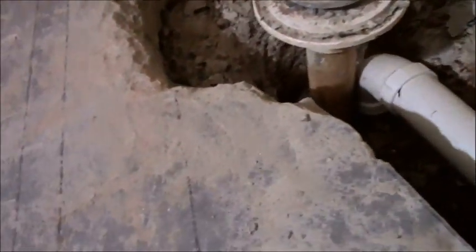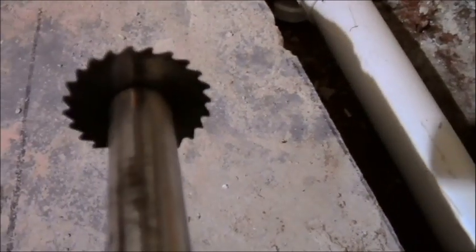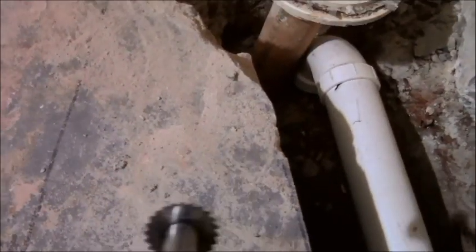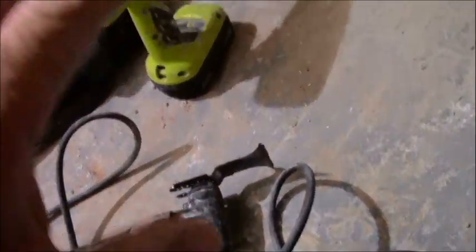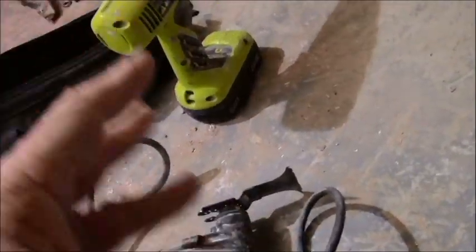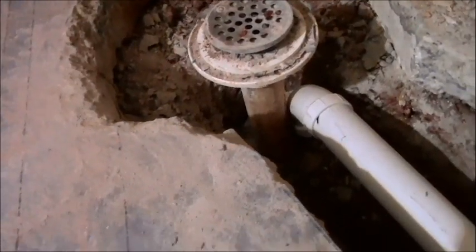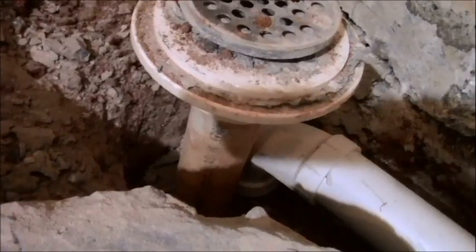And if I'm shy of that, then I can come in with an inside pipe cutter. It looks like a cowboy spur. If I need to take off another 1/4 inch, 1/2 inch, or whatever, I can go into the pipe and cut circular inside the pipe and get off any excess. So having good tools, not proper, because there's no such thing as proper, but having good tools that make your job easier, they really do. I can also tell this pipe is cockeyed.